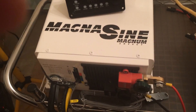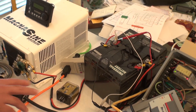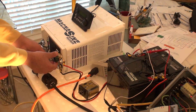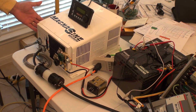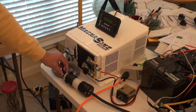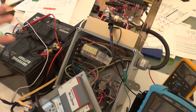I have two batteries here — these won't be the real batteries used in the final installation, just for the experiment. Each battery is 12 volts, 35 amp-hours, and I've put them in series to generate 24 volts fed into the inverter. I have two quick-disconnect switches to disconnect the DC going into the inverter. On the AC output side, I've connected the 240-volt output of all the microinverters, and at the same terminal I've brought a cable to this AC dump load we made here.